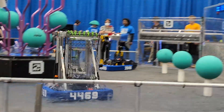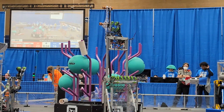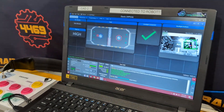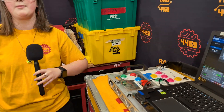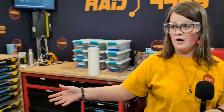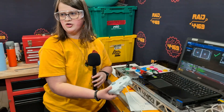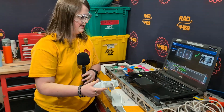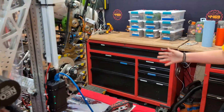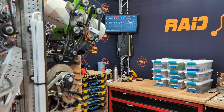Let's move on to the software behind your alignment. If you look over here on our screen, using our Limelight AprilTags, we can change where we are. We trust this value a lot because we know that our Limelight can be very accurate when we're so close to the field. Once we have our angle, all our driver has to do is push the button and it will automatically align. If we don't have a coral, it won't do anything — and then it'll drive to where it needs to go.